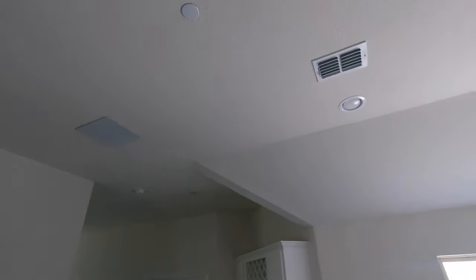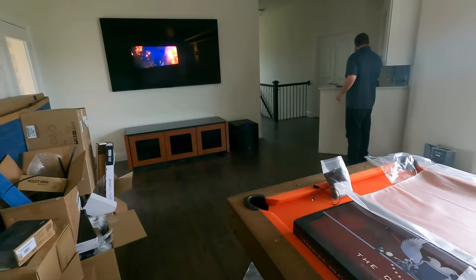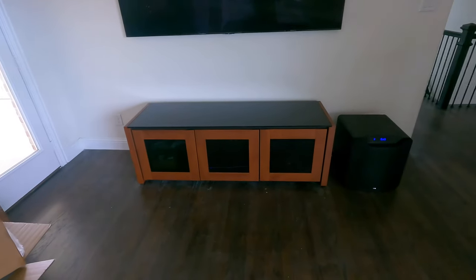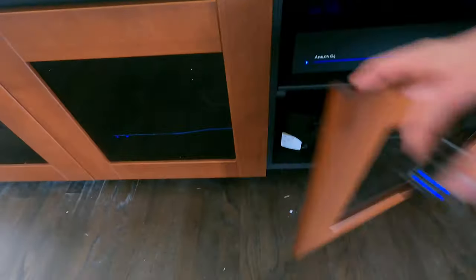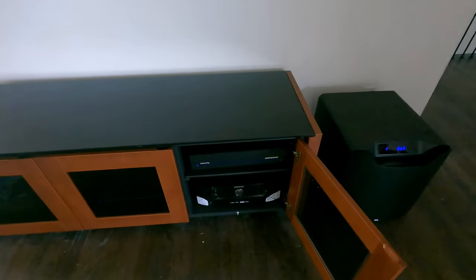We're going to talk about the ceiling speakers here. We got the Focal 300 series in-ceiling LCRs — these are massive, fully enclosed speakers — and we're using those across the front soundstage for front left, right, and center. Then we have the Focal 300 series in-ceiling speakers at the rear of the room. We got the SVS SV4000 subwoofer at the front of the room, and everything is being powered through the Salamander rack, which is housing our Marantz 7015. We also have an AudioControl Avalon G4 to power the front soundstage, because we want to maximize the potential of these speakers — doing separate amplification is going to make those speakers run clean.